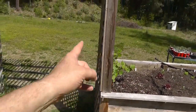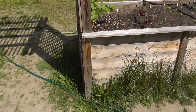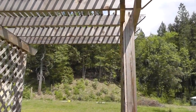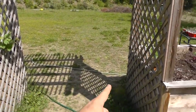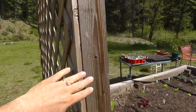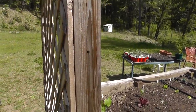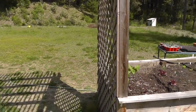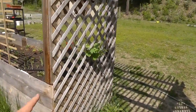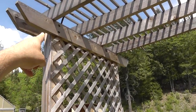For the arbor posts, I used 12-foot four-by-four cedar and sunk them into the ground three feet, so I've got nine feet sticking up to the top of the arbor. The center section here is exactly six feet wide. I dressed this up a little bit by taking some one-by-four cedar and putting it on here just to make it look nicer, because the four-by-four cedar looks kind of rough. Then I got four-by-eight sheets of lattice, which fit perfectly — four feet wide and eight feet to the bottom of the two-by-six.